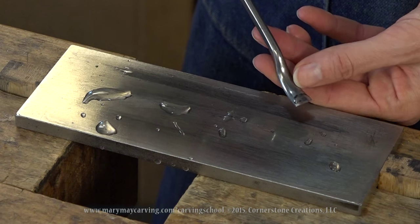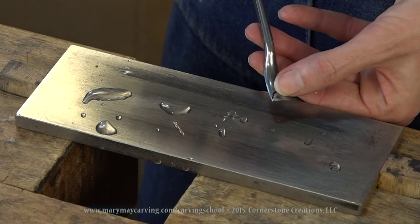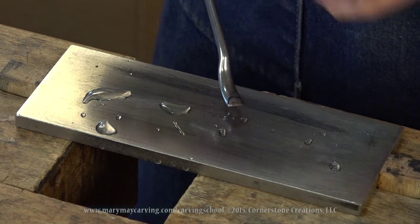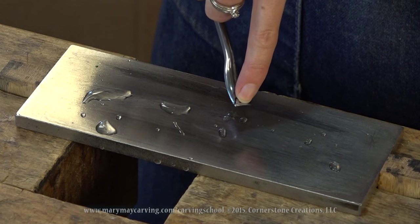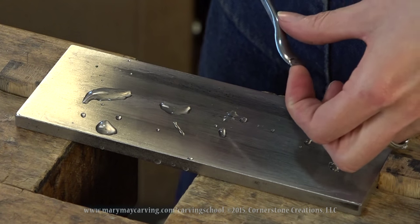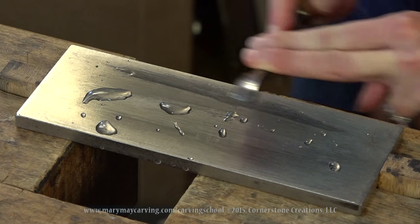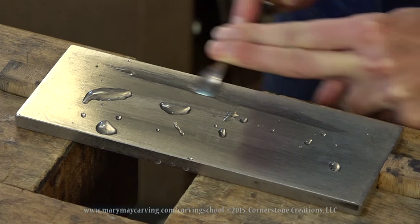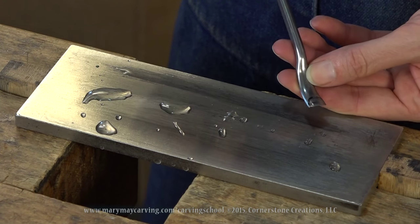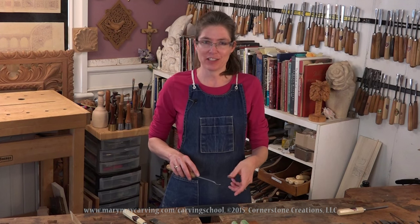You can see it's starting to hit a little bit of the flat surface there, but it's still really mainly focusing on just the edge. So just keep on doing this, trying to get that as flat as possible. It's important to make sure that from the tip all the way to the base is a flat surface. There definitely was a little bit of an extra curve on that, so there's actually a lot of metal to remove. Now there's actually a hollow grind right in the center, so you're going to see that it hasn't hit the center, but it's hitting at the base and also at the tip.